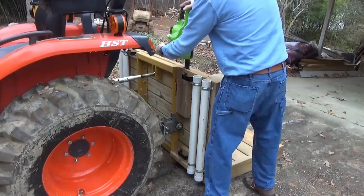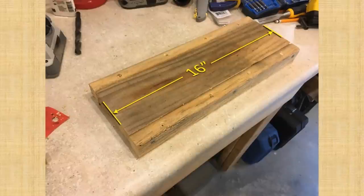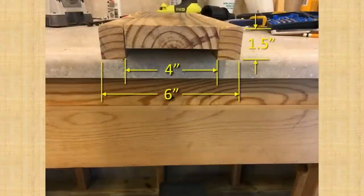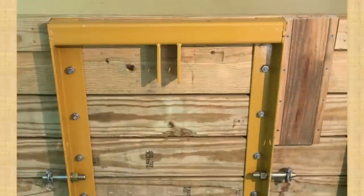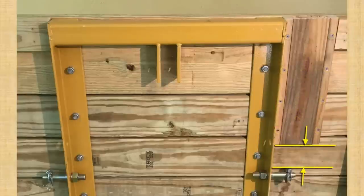Every carry-all should have a chainsaw scabbard — here's how I made mine. The scabbard is made of a 1-inch pressure-treated deck board. Since I have a 16-inch saw, I made the scabbard 16 inches long. The side pieces are attached with 2-inch deck screws. The center board is 4 inches wide and the side pieces were ripped to 1.5 inches on a table saw, leaving about a 1-inch wide slot for the chainsaw — total width is 6 inches. The scabbard is attached flush with the top of the carry-all and flush with the side of the carry-all frame using 2.5-inch deck screws. If your chainsaw bar is longer than 16 inches, be mindful of clearance between the bar and the 3-point connection pin — you might want to move the scabbard closer to the side of the carry-all.